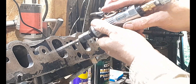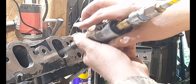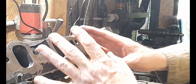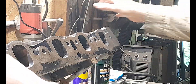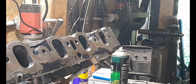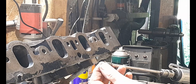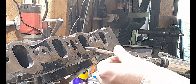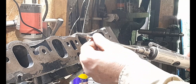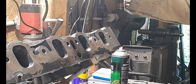It cuts down the chatter with the carbide because it's not grabbing and gripping as much, so it's much smoother and easier for you to manipulate the carbide. It keeps the dust and chips down. I'm not talking about pouring the stuff on, but you can give it a good generous coat of WD-40 or an equivalent — a cheaper brand works fine. That's a really good idea. It just keeps things cooler and will prolong the life of your carbide quite substantially, whether you're using cheap carbides or really expensive ones either way. I would highly recommend doing that.